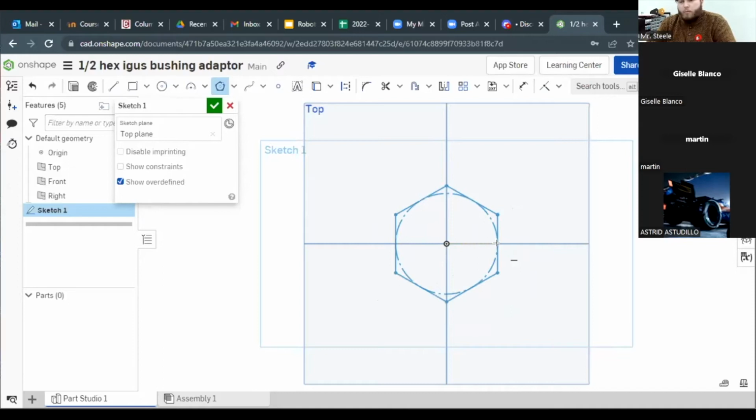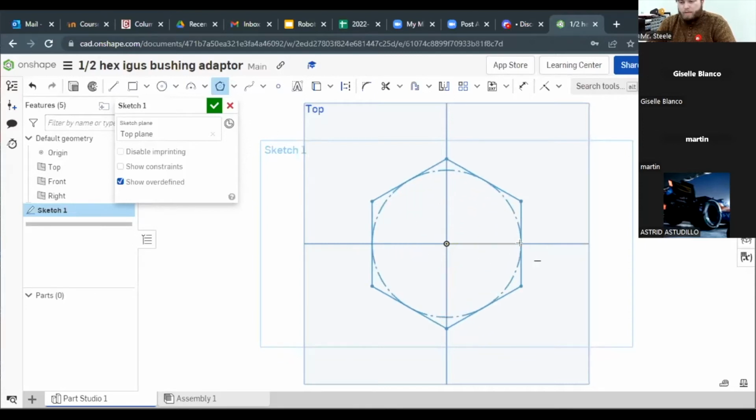Now, it doesn't really matter with what we're doing. However, if you've already drawn something, this part is important. Seeing as this is the first thing that we're laying down here, it doesn't really matter. So I'm just going to click along the horizontal plane, somewhere like that. And now, without moving your mouse, it goes, whoa, whoa, before I continue, how many sides am I making again? You can drag your mouse around without hovering, and it will change the amount of sides you have. You can go from 3 all the way up to like 1,000, but we just want 6. So when you hover around it until it says 6, and then you left click, it then goes, great. We have a 6-sided object and it's here. Where is here? 0, 0, 0. How big is here? We don't know.